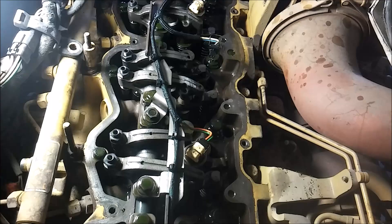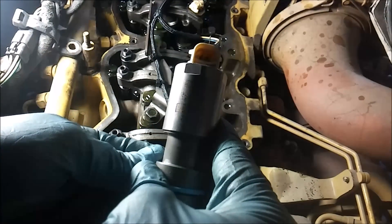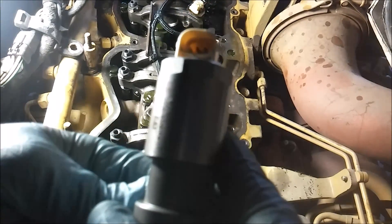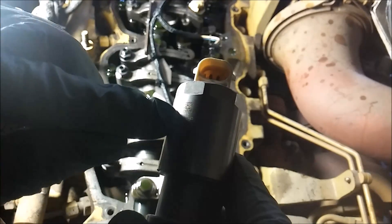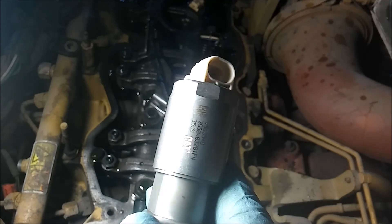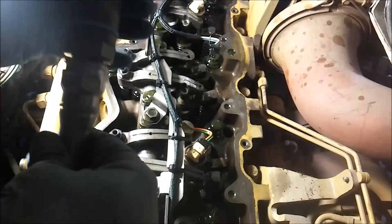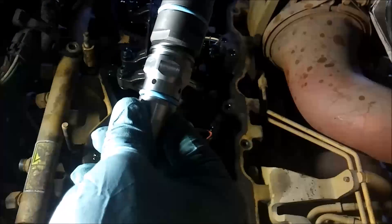So now that that is clean, we are ready to install the new injector. Here's your new injector - it's going to have a 12-digit and a 4-digit code on the side of it. You want to write those down just in case in the future you need to program the injector. It's got two O-ring seals. And the new injectors look like they have a missing O-ring in the center - they've redone the injectors, they've moved the lower O-ring down. I'm not sure why they've done that, but Cat did do that.